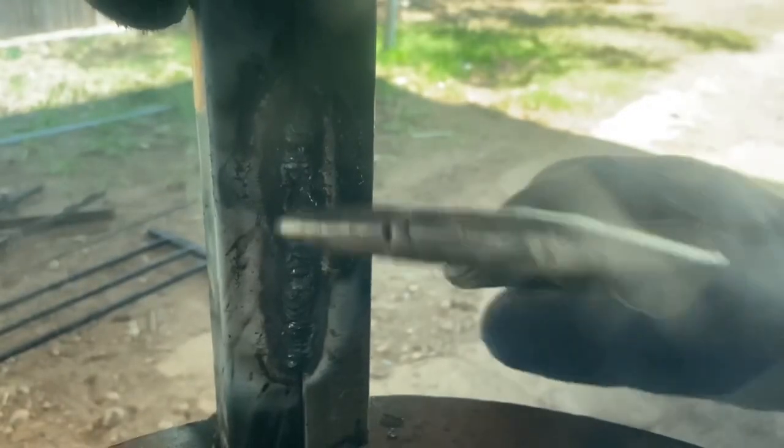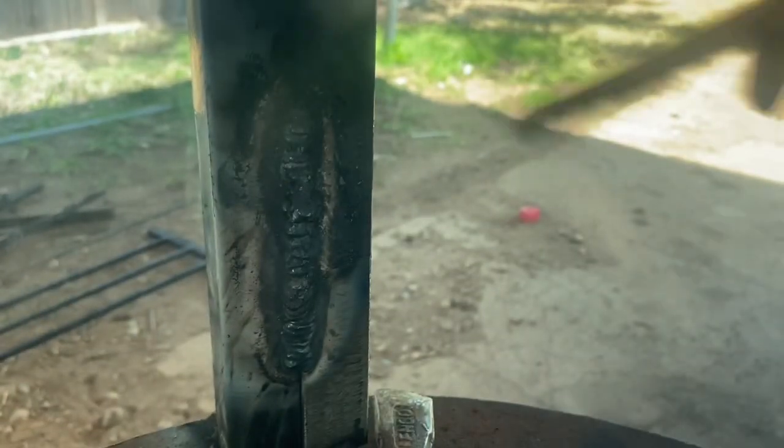These are the results — this is what it looks like when you recover from blowing holes on thin square tubing or thin metal with a stick welding machine. I'm using electrode 6013, 5/64 diameter. Thank you for watching.